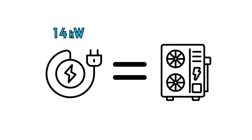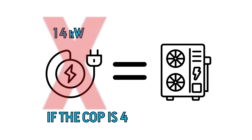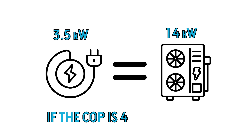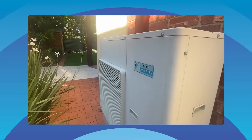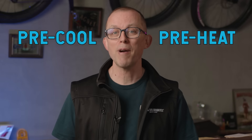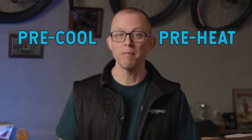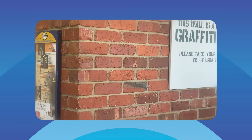A 14 kilowatt aircon is not drawing 14 kilowatts of electricity — it's providing a maximum 14 kilowatts of thermal output. If the COP is 4, a 14 kilowatt unit only draws around 3.5 kilowatts of electricity at full power. Most modern systems are inverter-controlled, meaning they can run from 0 to 100% and almost everywhere in between, rather than just full throttle or off. Once you're at temperature, a good unit will cruise at a fraction of peak draw, just enough to maintain temperature. If you've got solar, use the sun while it's there — pre-cool or pre-heat your house from late morning to mid-afternoon, then hold a comfortable set point into the evening. Unfortunately, most Aussie homes have low thermal mass, poor windows and poor insulation, so don't expect it to last all night unless you've upgraded.